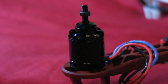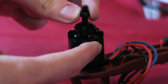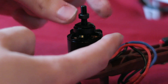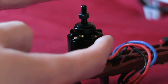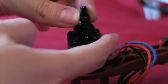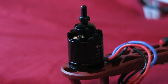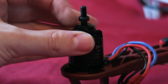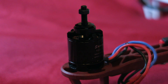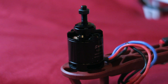Another good way to verify this is to hold the nut with your hand, then move the motor in the direction it should turn - the nut should screw itself on. This is the back left arm which is a counterclockwise arm, and if I move the motor it spins down and locks itself. Alternatively, unscrew the nut to the top, then arm the quadcopter and the nut should travel down the shaft and lock itself.